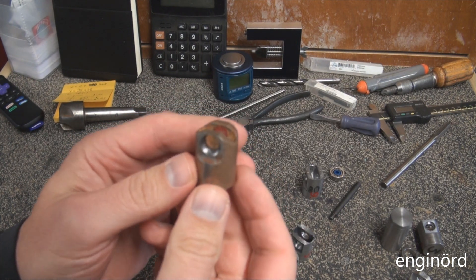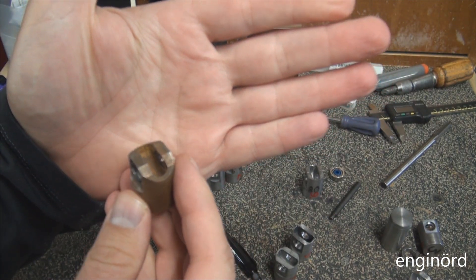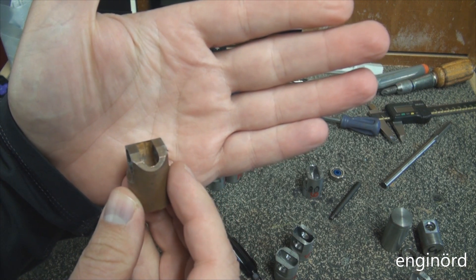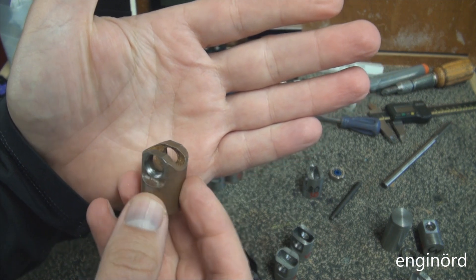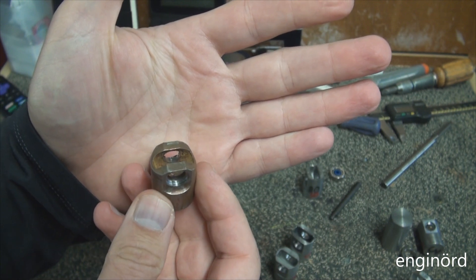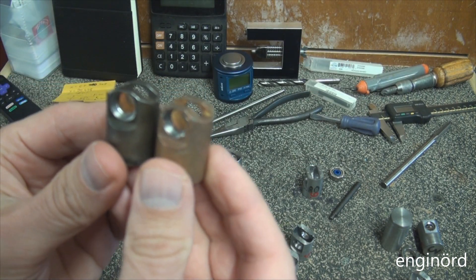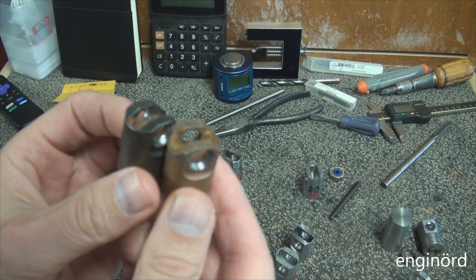This is the really first one that I worked on and it has a double relief cut. This should be 30 degrees, but on the first one I didn't set it up properly, so I cut a 60 degree and then a 30 degree. These were done on the Bridgeport and now I am going to use the Fryer CNC to hopefully get better results.